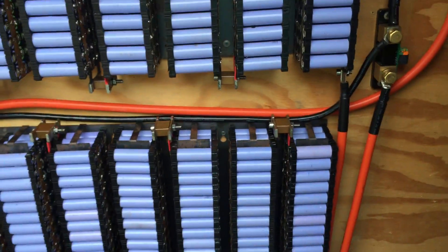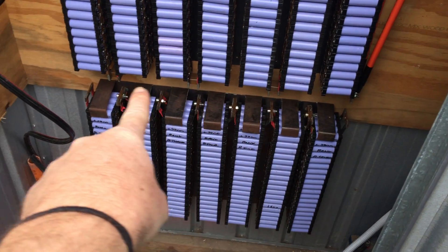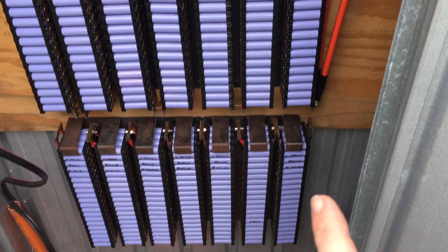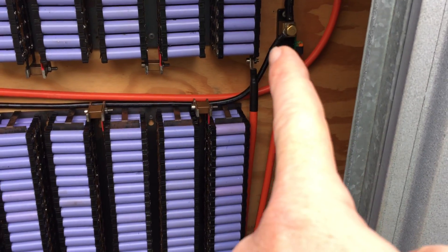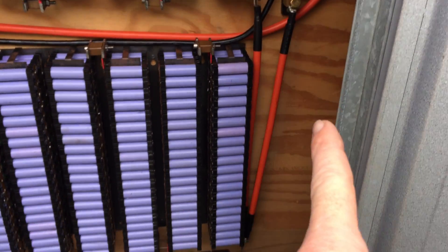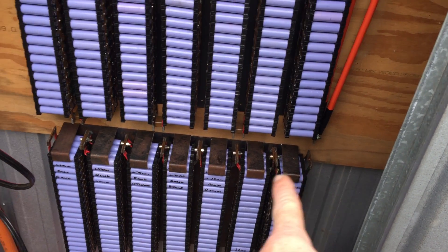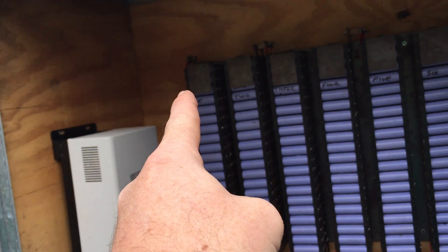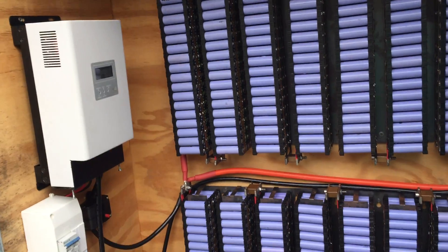Because I've got three packs now, I'm trying to draw the power as evenly as I can. It's a little bit hard with three packs — it's called configuration. The bottom pack has all the bus bars at the top rather than top and bottom. So basically what I'm going to do is run another cable from there down to that bottom pack for the negative, and run that all the way to the top.